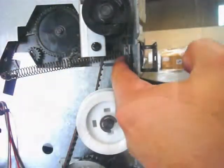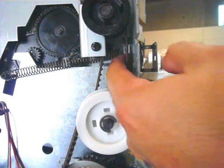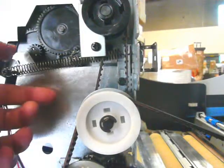There is not a straightforward method. Every machine is different and you will need to experiment with different spring tension locations and bracket height positions. In this situation the highest spring location and the highest bracket height was not enough. Try looping the spring above the bracket.